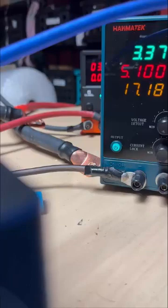The science behind what's occurring is that the amperage you're putting out is a factor of both the voltage of the unit as well as the resistance. When we're using smaller wires, we're adding a lot more resistance than when we're using larger wires, even if the wires are sufficient for the amperage. We can still cut down on that resistance, and it's going to keep charging at its maximum value a lot longer.